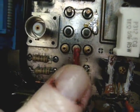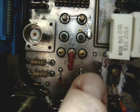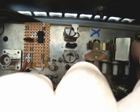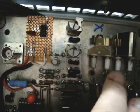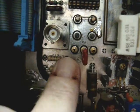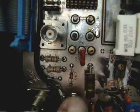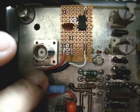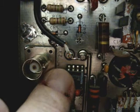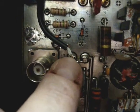This is the P6 jumper. It usually goes from the middle position to position three when using the crystal oscillator. In this case, I've just got the crystal in the socket halfway — we're not using it. So I've taken out the jumper and just placed it in the middle so it's not connecting to either side, and we've got just the oscillator running going directly into this chip here.